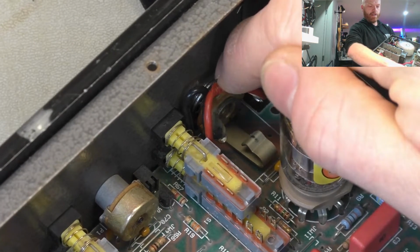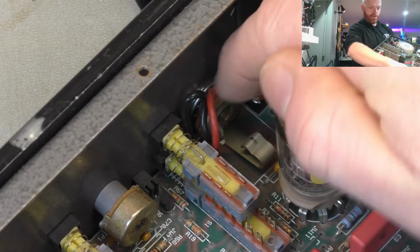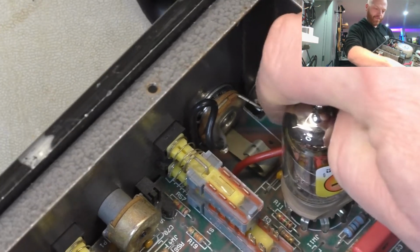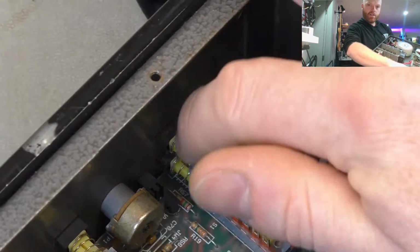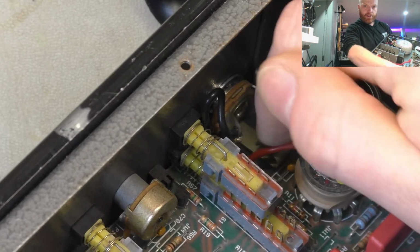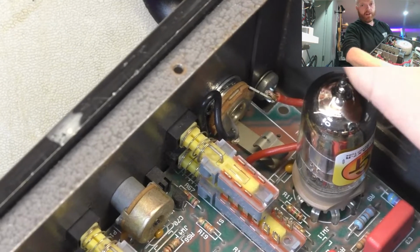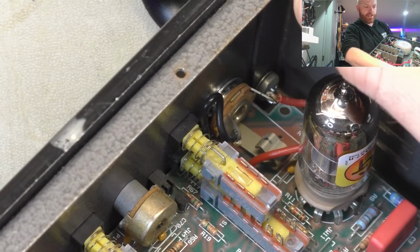So here's that input jack. That looks almost like this valve melted that wire, but looking at the diameter of the burn, I think that was actually a burn from when the jack was installed. The solder joints are dry, with almost no solder on them. They're starting to fray and break. It's just too heavy a gauge of wire, really. It's almost like they've stripped a bit of speaker lead and pulled the wiring out of that. Same goes on the ground side, but particularly this jack is not a shunting to ground type, which means that when there's nothing plugged in, it's not shorting the signal to ground, so there's excessive noise. So we'll replace that. We'll redo the wiring with a proper shorting jack.